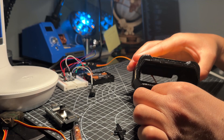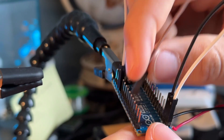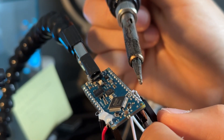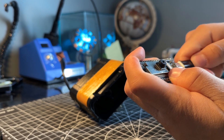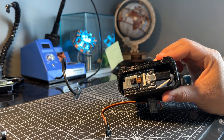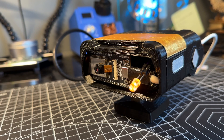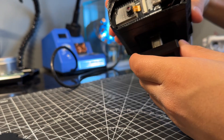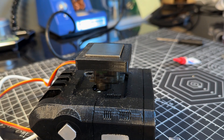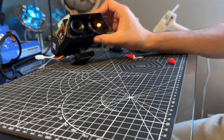Now it's time for the assembly. I attached a servo on the outside with a head on the inside, which I glued. Then I attached the wires directly to the Arduino and soldered when I needed to. Then I plugged the ESP32 cam into a short USB-C cord which went directly to a tiny power bank that I bought off of Amazon. After this, I put all the electronics connecting to the Arduino inside of the Pico head and made sure that the LED was sticking out. Then I super glued the servo base and the magnet which keeps it on my shoulder. That nervous-shaking Pico effect is actually caused by this magnet interacting with the gears, but I liked it so much I decided to keep it, and went on with gluing the rest of the project.